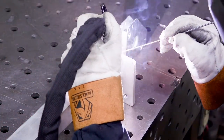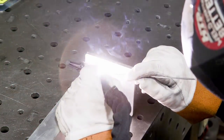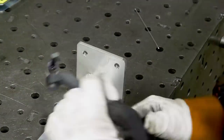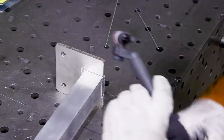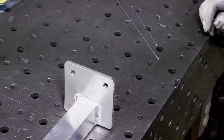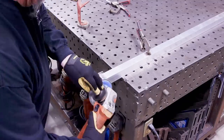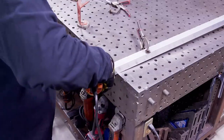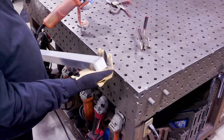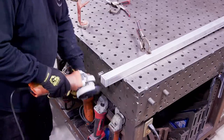One disadvantage of aluminum is the time it takes to weld using TIG with a foot pedal — you have to drag the pedal everywhere you go. Some torches have a push button or slide switch, but I'm going with what I have. Grinding the top caps now — beeswax on the flap disc works wonders to prevent clogging and grinds aluminum really well. Just smoothing these off since one will be near the latch.